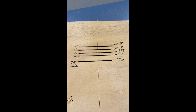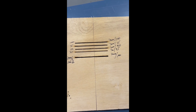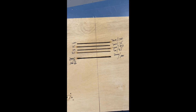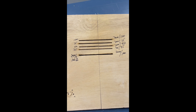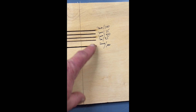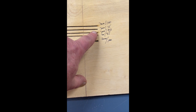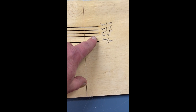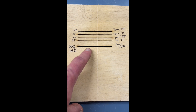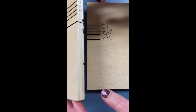So we just ran some tests on the bolt. This is the 4 inch lens at my normal 1.7 millimeter focus, just like the original ramp test — nothing hinky, nothing funky on setting your auto focus. We just randomly picked 7 millimeters a second. Then we started at 100, 75, 50, and 25% power. And then for fun, we did 2 millimeters a second with 100% power. Now we're going to look in and see what it looks like — how deep it went.